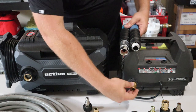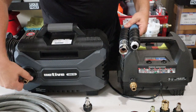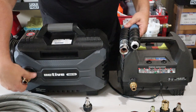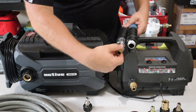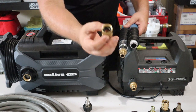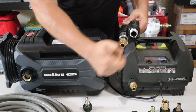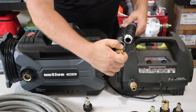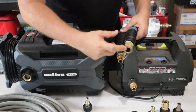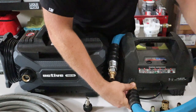The first thing you have is your male end, which is going to go on your units — this is the exact same size for both pressure washers, so it's all industry standard. The female end from your hose is going to accept this. Coming from your house, you're going to attach this to your spigot so you can connect your hose to your house and quick disconnect when you need to move it around.